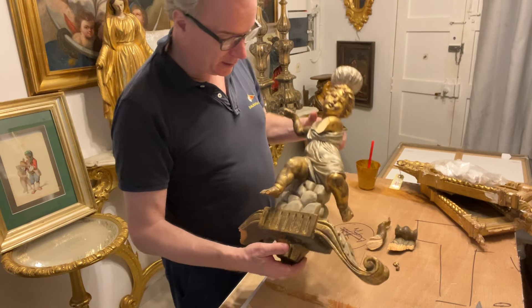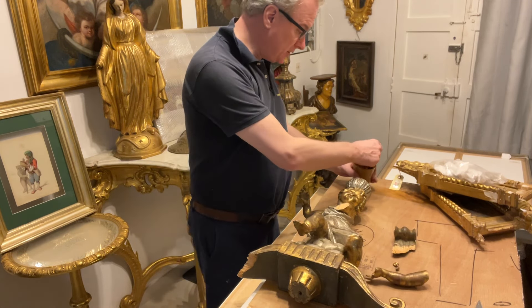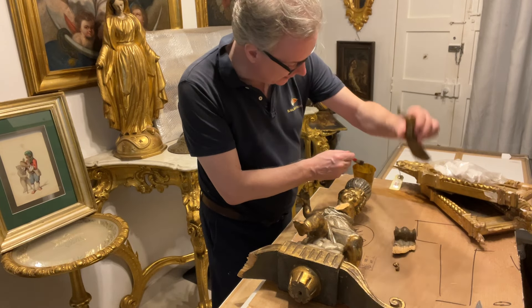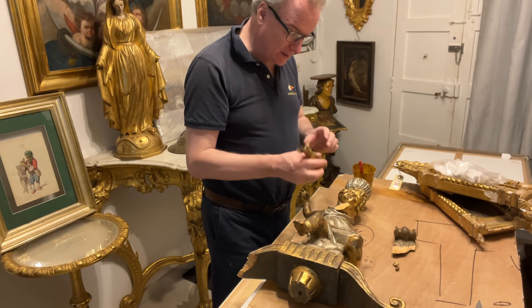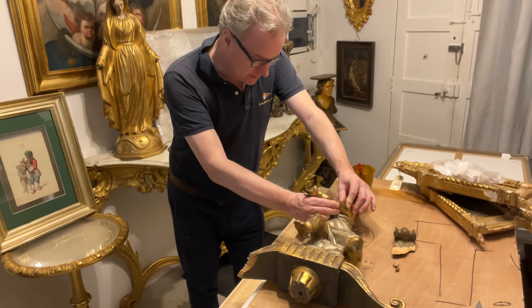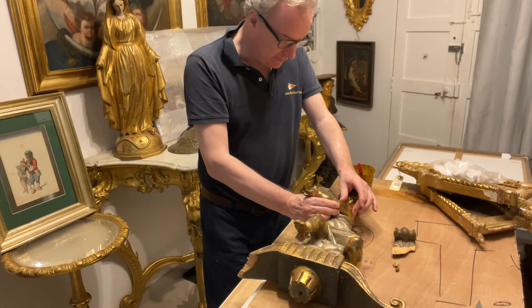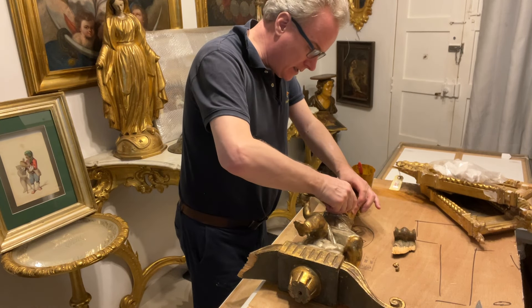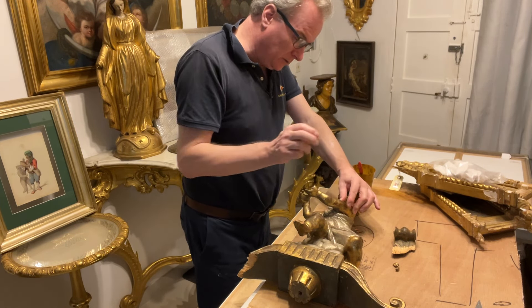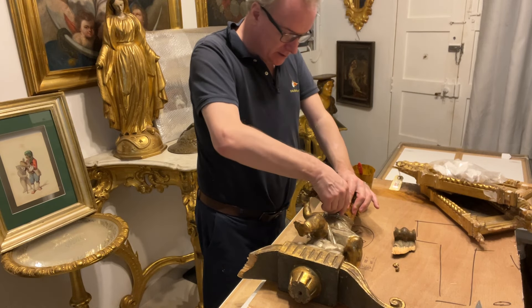I need to glue the arms on. I'm not going to use a clamp or anything special — just pressure only. Hide glue has the rather strange quality of hardening when it cools; it doesn't harden when it dries. I put it in place, I can feel it's in the right place, I'm going to move it slightly to get it just dead right. The glue cools and hardens and stiffens — it does cure and dry ultimately, but it is the cooling which makes it stick. That's stuck on.